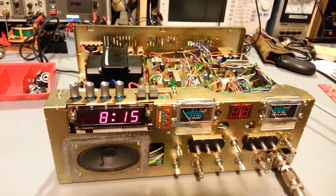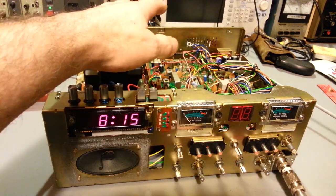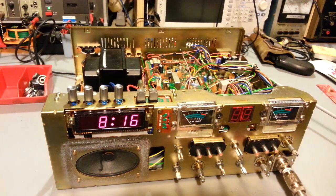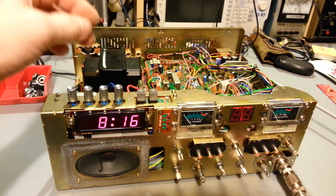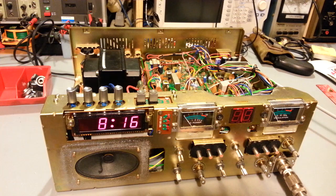Now I can get into actually doing the electronics work on this, get it all put back together, and it'll be ready to put back in service. Because this is, without a doubt — and pretty much anybody who's ever owned one will agree — probably one of the best sideband radios ever made. It used the Cybernet chassis with the dual circuit board. They're just so quiet. Very few other radios have such a quiet sideband receiver. They had a fairly narrow crystal filter — it's not a monster like you'll see in some Uniden chassis, but bigger than modern radios. It has a fairly narrow bandwidth, and that's why it's just so pleasant to listen to — it's a really steep-skirted filter with really good attenuation characteristics.